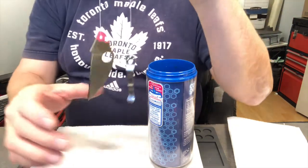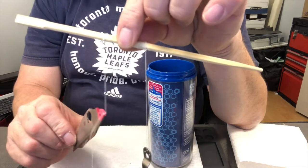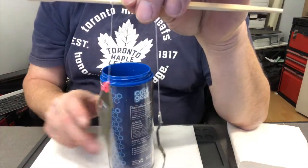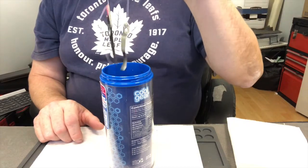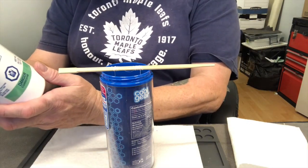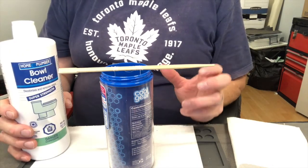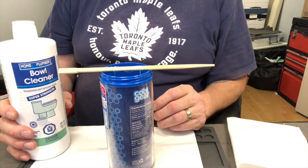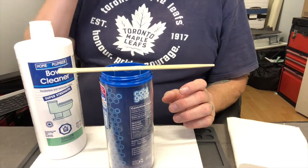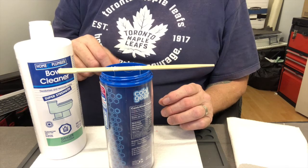Our pivot is painted up but it's not quite dry yet, so I'm going to let it dry and harden up and then fill this cup with the hydrochloric acid — well, muriatic acid — and find out what it does. This toilet bowl cleaner contains hydrochloric acid — it's basically a super-strength toilet bowl cleaner for hard water calcium deposits. It's kind of a weaker acid than pure muriatic or hydrochloric, so I'm hoping it will still etch the metals, maybe just taking a longer time.